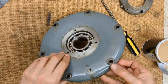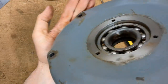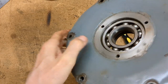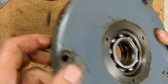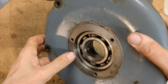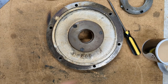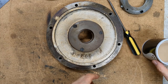and you can also see there on the inside, bring this up a bit, there probably are some scuff marks. They even look like burn marks, but could that be? I don't know. Anyway, it looks like that's been running on the spindle and the bearing is jammed at some point. So we're going to have to get this out. It looks like we can take this cover off and push it out from one side or the other.